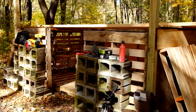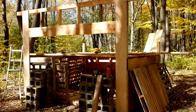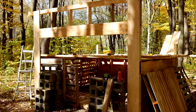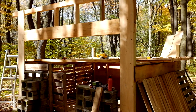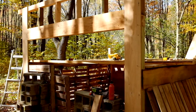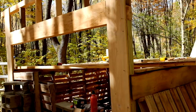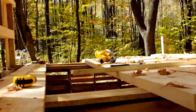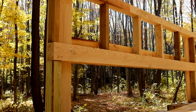I only have the one camera today so there won't be any time-lapse. We have our front knee wall built to support the roof, and we have this one-by-ten siding material up. We used that to help get everything in place — we actually secured the one-by-tens to the four-by-fours first and then laid everything up against them, which made it really easy to get everything in line.